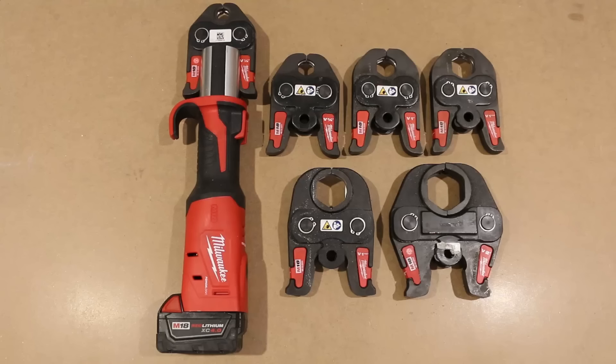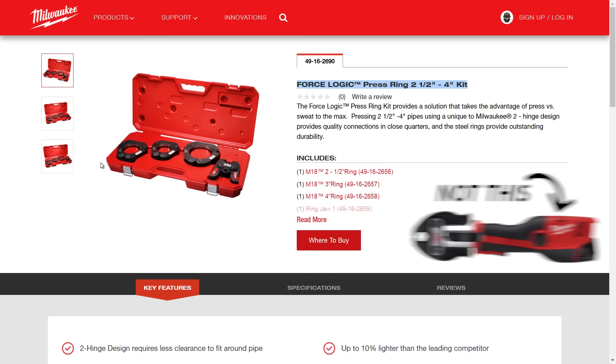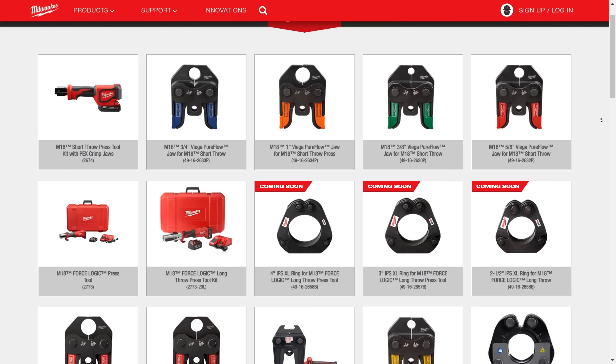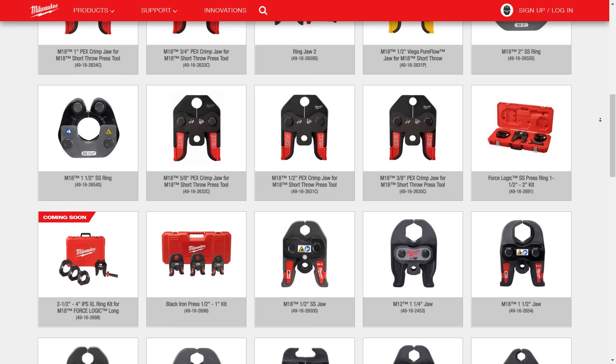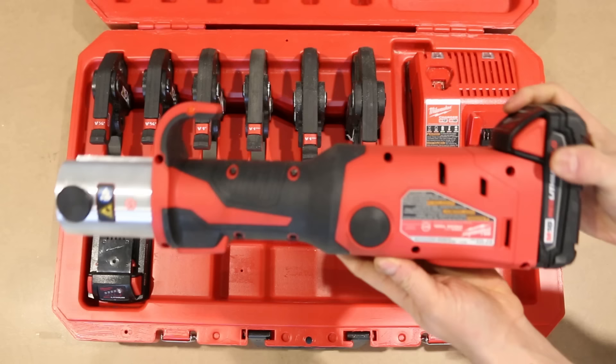There are many different varieties of press tools and kits for each specific job you're doing. For example, if you're pressing a 4-inch copper line, you'll need an 18-volt press tool and not a 12-volt, with the correct crimping ring to get the job done. Since there are so many possible combinations, I'll link a file in the description box below to all the combos for your info. Apart from that, the tool is quite foolproof when it comes to using it, which is why it's so easy to integrate onto a jobsite. A kit like this is pretty expensive at around $2,000 and can go up pretty quick depending on the batteries and attachments you get with it, but it sure does pay off in the long run.